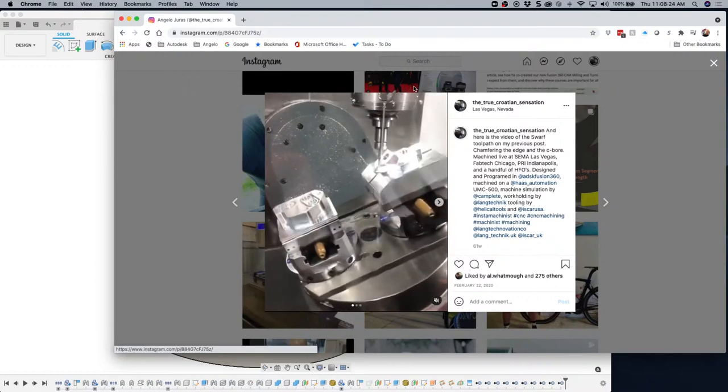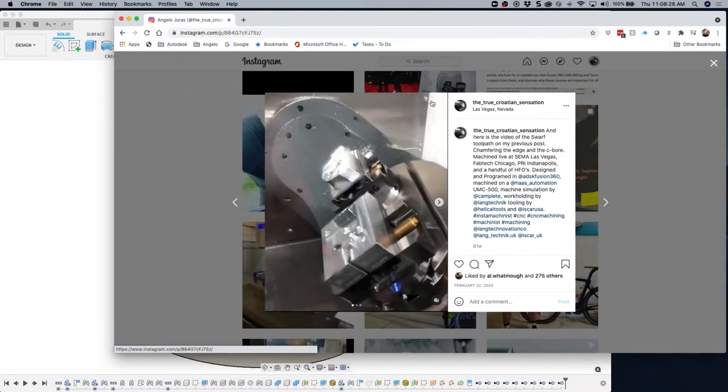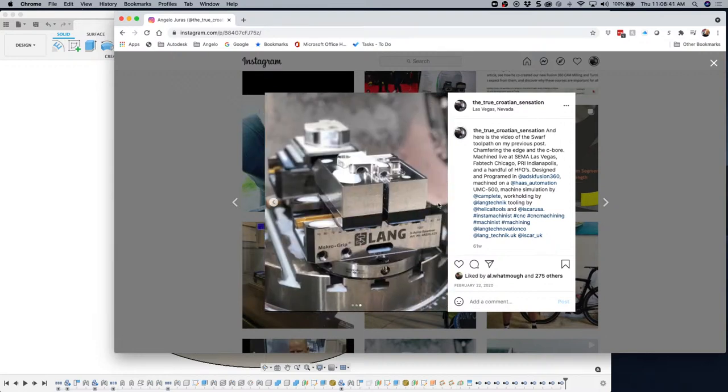There's other techniques that you could use to do that. So I use a side flute of the end mill, and that's just gonna loop through. And here's another view of that. There's the solid piece of stock. These are the soft jaws, before I machine the pocket. And here's another view of that. So with that, let me come back to, I can close that.